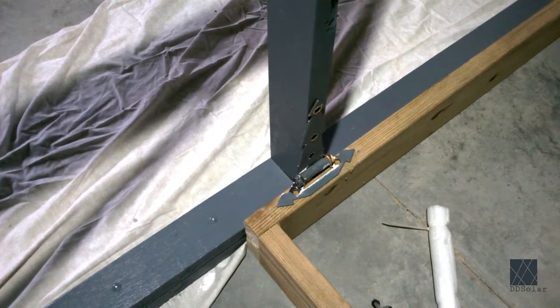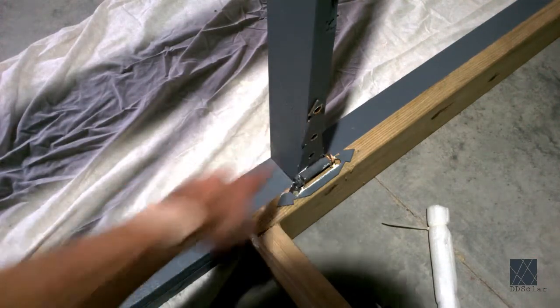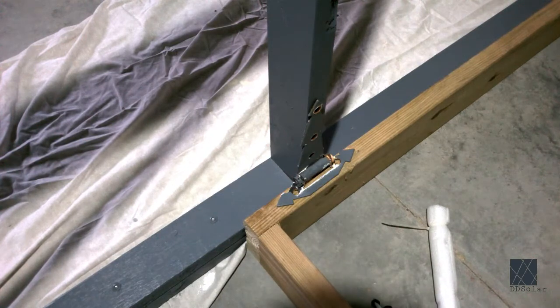Right now I'm doing the hinges, and I decided to just put the frame at 90 degrees to the base. I want about 5 inches of overhang, and this will give me about 5 inches because those are 2x6s and they're 5.5 inches high. The hinge is probably an inch or 3/4 of an inch. So I'll just snug the frame up against the base, put the screws in, and it's a little bit warped, so I will have to fool around with it a little bit and get everything in alignment.